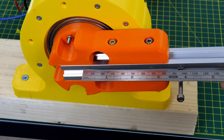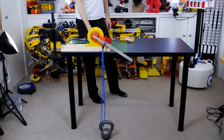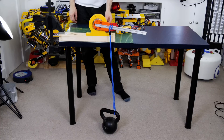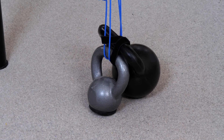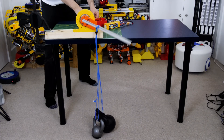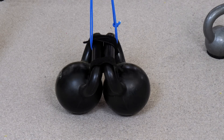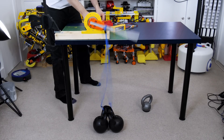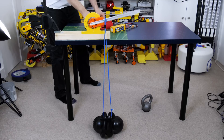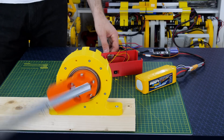I've screwed in a screw 100 millimeters from the center of rotation of the output. First we're going to try a four kilogram mass tied on a string — no problems there. Let's try eight kilograms — that still seems to work fine. What about 12 kilograms? The motor driver is having some issues, but if we go at the right speed it lifts it with no problems. And now 16 kilograms — this is where the motor driver can't handle it. Ideally we need an ODrive or something that uses an encoder, but my gearbox is still intact with no mechanical issues.